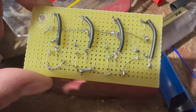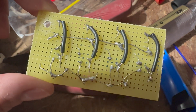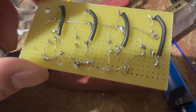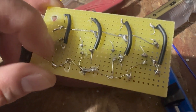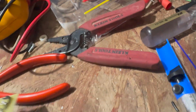This is what happens when you look at a schematic and you're tired and you want to just finish it and you cut corners. I put these jumpers on, and this here wasn't connected — I didn't connect the bias input to the bottom of the pot. So I missed out on a lot. I'm going to go put it back in now.